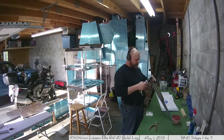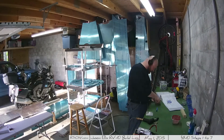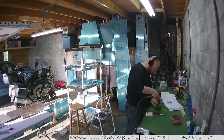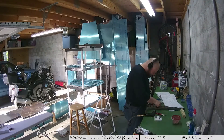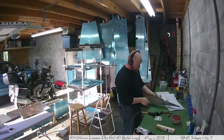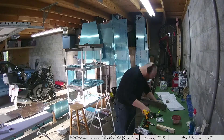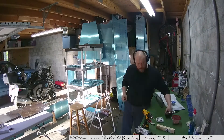Now the part is primed and I'm beginning the riveting process of this elevator. This is the rib tips - the inboard and outboard rib tips - getting those things riveted together with the various rivet types. Pretty easy, no big deals. Beautiful day - you can see how sunny it is in the background. Sometimes I wish this was open to the sky because it's just gorgeous out.